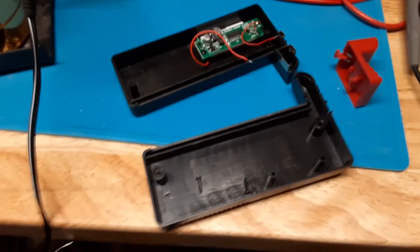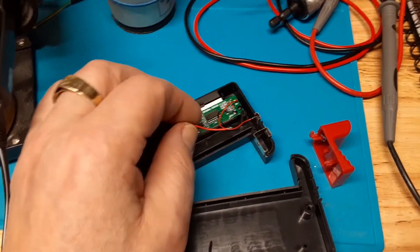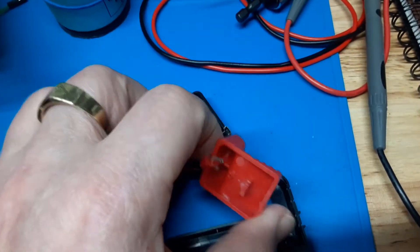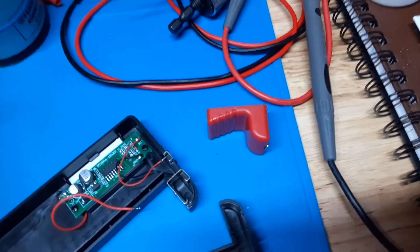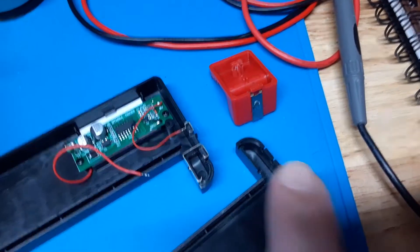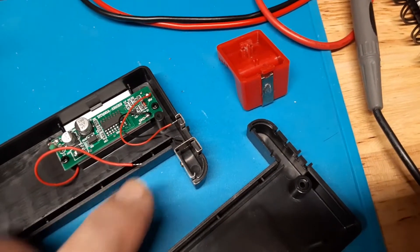This is what the meter looks like after I took it apart — there are two little screws you unscrew from the rear. This is where the problem is: this wire breaks off, usually off of this part right here, and it's really easy to solder back on. I also added a little drop of solder on the battery contact because some batteries are too flat, so that little bump made it work much better. I use this so much that the wire, moving back and forth, basically just breaks off over here.